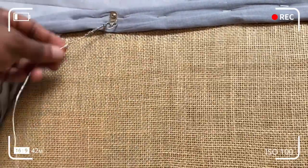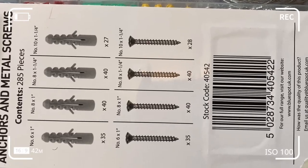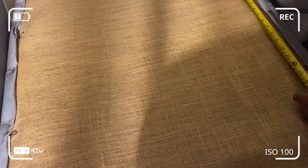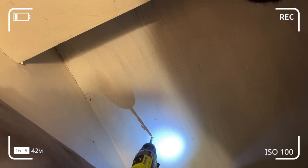Install the acoustic panel onto the screw or onto the eye hooks installed in the plug of the wall. The diameter of your screw or eye hook will determine the type of plug you use, as coloured plugs come in various sizes. Repeat the process for your eye hooks — use a drill bit slightly smaller than the eye hook, pilot drill the hole, then open it up to the final size. Once you've installed your eye hook, hang the acoustic panel with the hanging wire onto it. Drill as many holes as required, install your plugs and hooks, make sure the plug is flush, and then hang your acoustic panel.